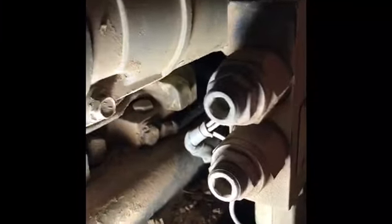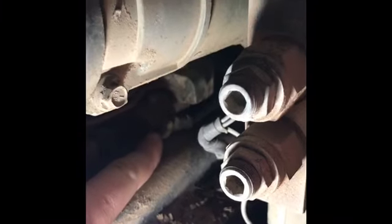Next, disconnect the electrical. You're going to have a couple of lines coming off your engine starter and most of your other electric lines to the right of the machine. There's a bus right here that you will have to remove from your engine. Your ground is usually down here on the engine — go ahead and remove that too. There are also a couple of wires coming off your starter that need to be removed.